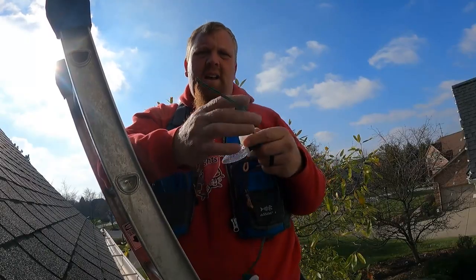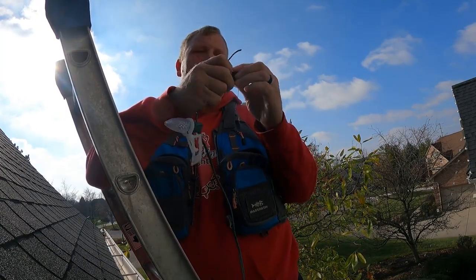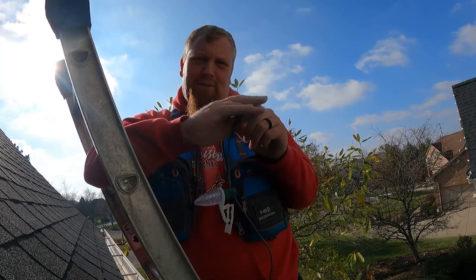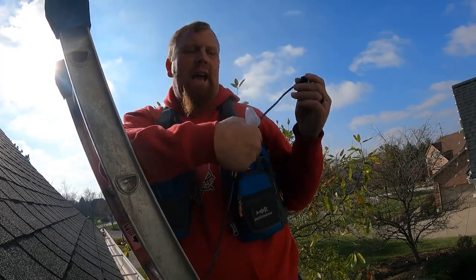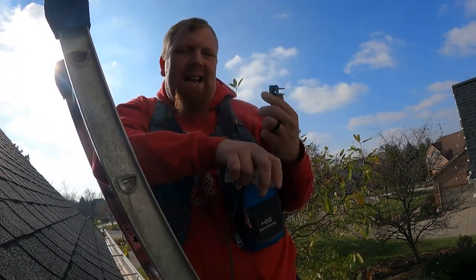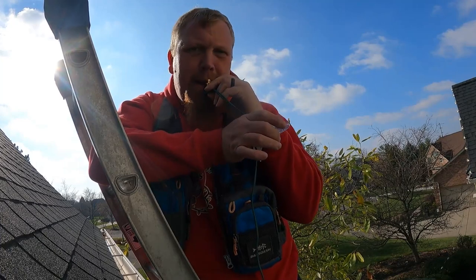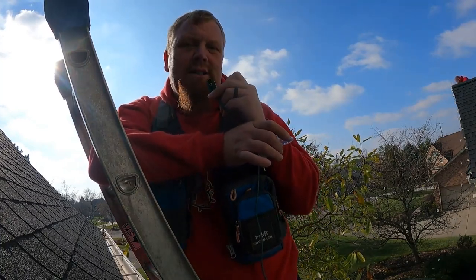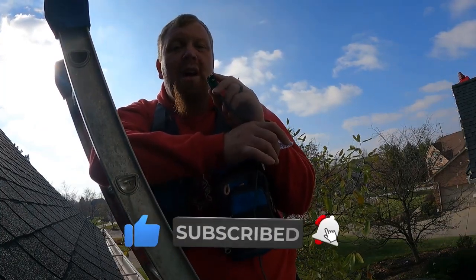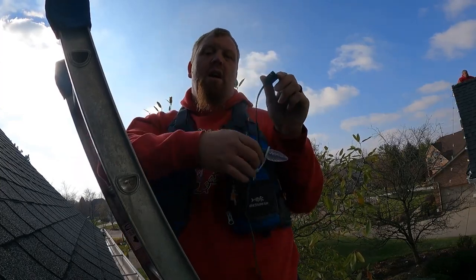Anytime our power is coming from the source, lights off means you get a male; lights on means you get a female. I know I'm hitting on this hard because a lot of people do this wrong and I don't want you to get shocked. One of my guys, when I had my business doing a million dollars a year, would take his teeth and slide connectors on. Another guy on the ground put a hot male right to his lips and it shocked him across the lips, left a mark, and knocked him down. If he'd been up on the roof, it would have killed him.